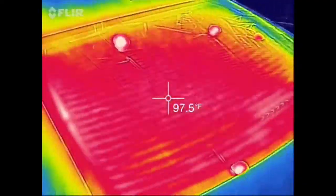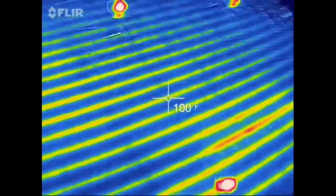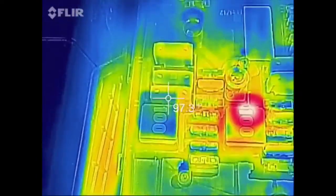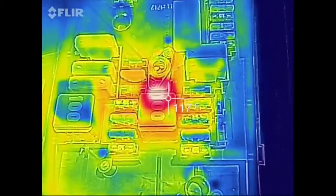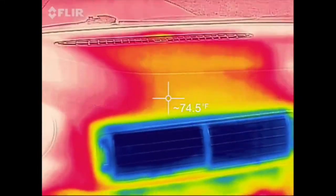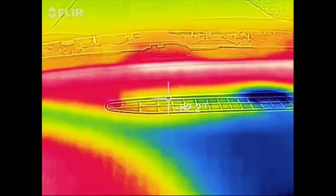Firefighters use thermal imaging cameras to see the various temperatures in the fire. Also, when analyzing an engine, for example, the hotter parts can easily be picked up by a thermal imaging camera. Electrical installation and fuse boxes can be checked for excessive current draw with thermal imaging cameras. The video output format of a thermal imaging camera can be in the form of a motion JPEG or H.264 stream, and as such can be digitally recorded as a normal video signal.